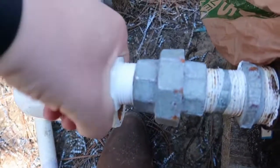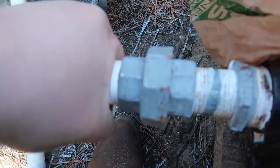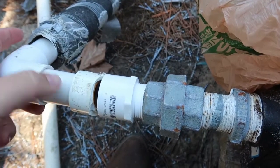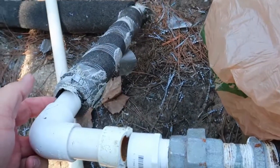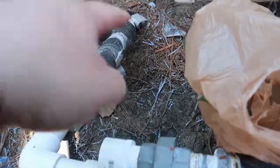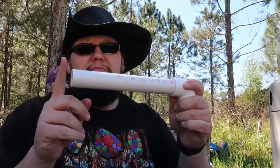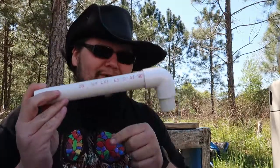If I look here, I probably have enough if I cut it here to go in there, but I feel like it puts too much pressure on this pipe. So I'm just going to go ahead and add the new pieces so that way it gets a little bit more, and then I'm going to try and stabilize that elbow at the bottom there. So I went ahead and cut it down there lower — I've got to cut this elbow off because I've got to put a brand new one on there, and then put the couplings here back into the other piece of pipe, put the new elbow on it, put a new piece of pipe here, and that'll slide right into the adapter that I put on the pump itself.